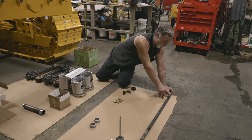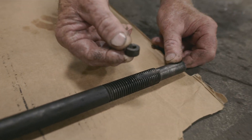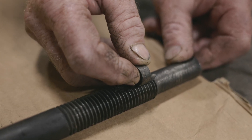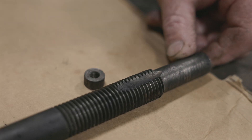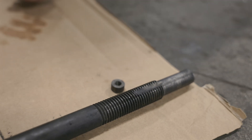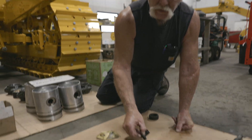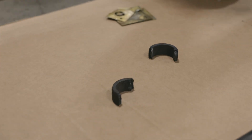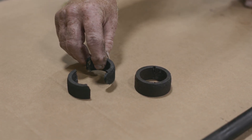There's a little slot — they have a little ring in there — and once you get it into place, that ring keeps it from turning so you can put your top nut back on and the whole nine yards. Around that top nut they had these rings which sat in there. Very few came out, so we ended up torching them out, and then had new ones made.